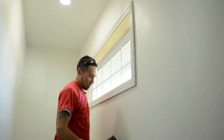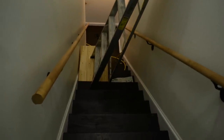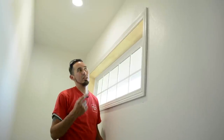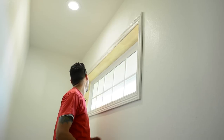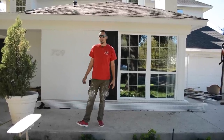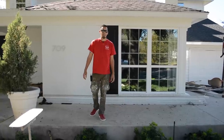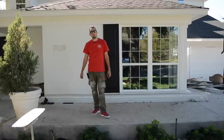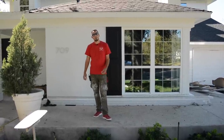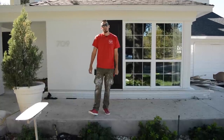There you have it. One little trick: if you don't want to be going up and down all day, you can just build a window surround as a whole unit and slide it in — just double-check those measurements because you definitely don't want to make it twice. Thanks so much for watching. Hopefully you enjoyed seeing us do that — it's a pretty cool way to frame out a window in one piece and save some time. All the tools I used will be in the description below. Let me know what you think about the GoPro-style chest-camera videos in the comments, and we'll see you next time.